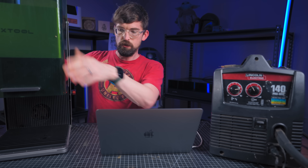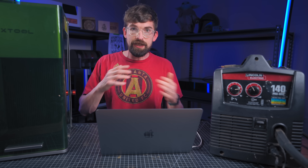A lot of people refer to lower wattage machines as engravers, and typically fiber lasers at that level are set up for engraving. The work area is small because cutting metal requires much higher wattages — hence the 800 and 1200 watt range. Huge industrial machines start around 2,000 watts and go up to 3,000, 5,000, and beyond, with price increasing accordingly.